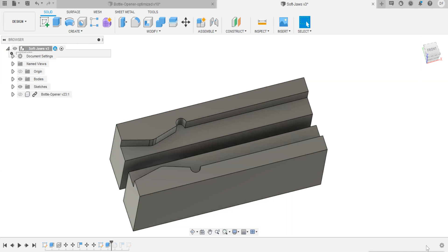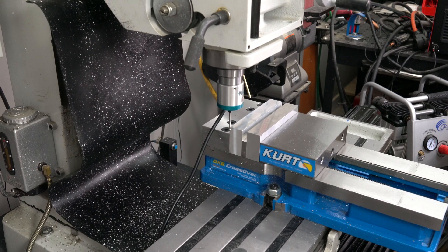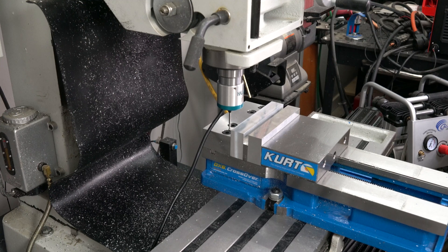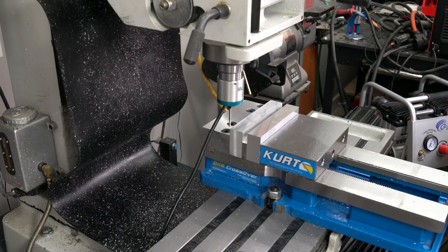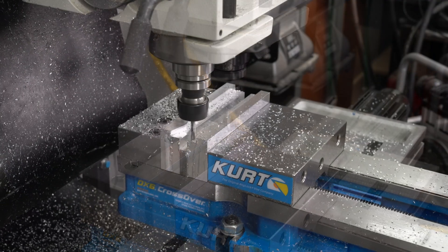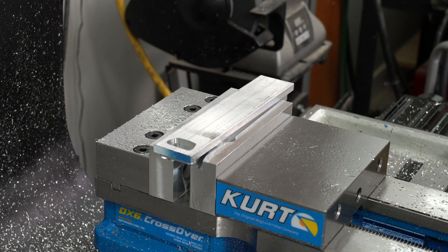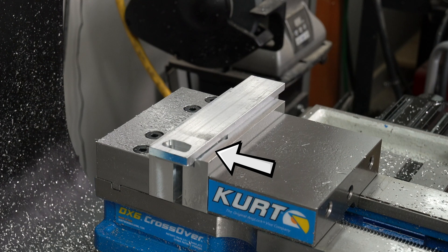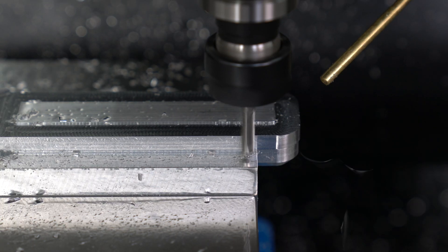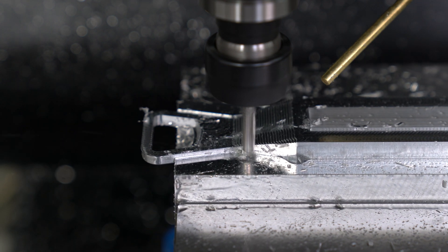I added a large radius where the slope meets the handle because end mills have a tough time reaching tight internal spaces. The spacing between the jaws is set to be the thickness of two parallels, which will be clamped just below the region that will be cut. When the soft jaws are clamped they deform a slight amount, and this is the state in which they will be machined — so make sure they are clamped to something when probed, or else back-side cutting operations won't match up with those on the front. The back left corner on the fixed jaw is the probe point. The soft jaws were easy to make: just a 2D clearing operation followed by a 2D contour for a smooth perimeter. When I place the part into the jaws and tighten it down, the V portion squeezes and locates the part to the correct position. That last contouring operation is oddly satisfying to watch, and there is a very minimal ledge on the perimeter — good registration between front and back.